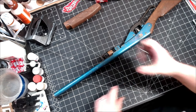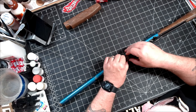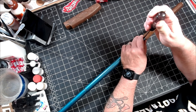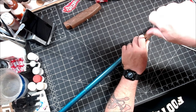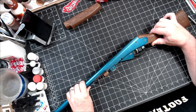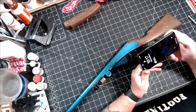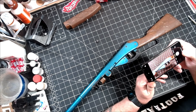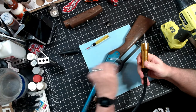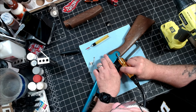I'm going to take a bunch of pictures as I go, because there's not a lot of information out there on this, and I want to make sure I can get this all back right. That wheel is just kind of loose in there — it sits on a loose axle, held in by both sides, and then the hand grip actually locks it into place. The rear stock has a screw in the top that just unscrews, and then it's held in by these rivets. I think these are tubular rivets — the kind that works best for working on Tonkas. I have some tubular rivets and a tool for doing that, but I don't think I have any that are long enough. So I ordered some, and for now I'm going to put this back together using screws. If I get the right tubular rivets, maybe we'll do a quick update video.